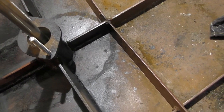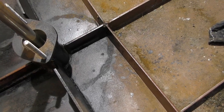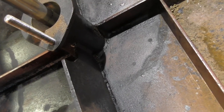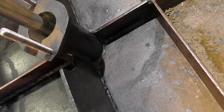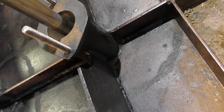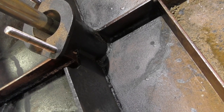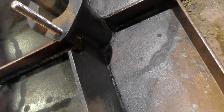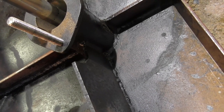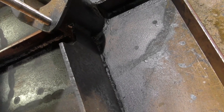Just a quick look at how I treated the rust around this area with that chemical. In those tight spots, it's really hard to get any useful rust removal — wire wheels just never do it 100%. So I wire-brushed the surface rust away, vacuumed it out, and then sprayed this chemical on there. Basically what it does is convert any remaining surface rust into ferric tannate — I can't remember the exact name — but anyway, that should be ready for welding up.